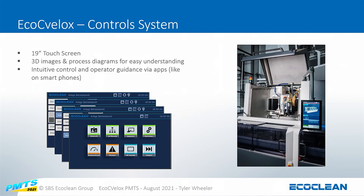When we looked at the controls we wanted to do something different, so we went with a 19-inch HMI and reconfigured the whole HMI to be more like a smartphone instead of a traditional HMI structure — a little more intuitive to work with. It has 3D models integrated so you can actually see the machine working. We even integrated fault indicators so that if a module has a problem and the machine goes into a fault mode, the module itself lights up a different color so you know exactly which module had the issue.